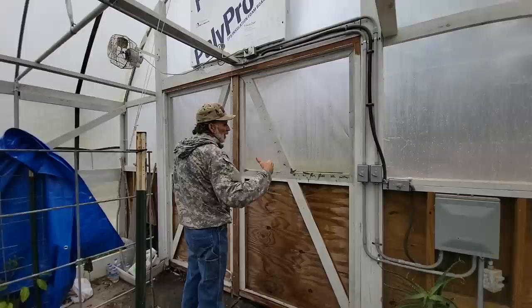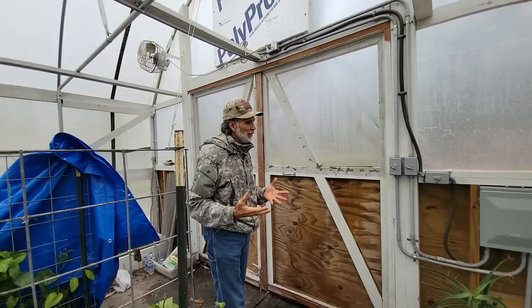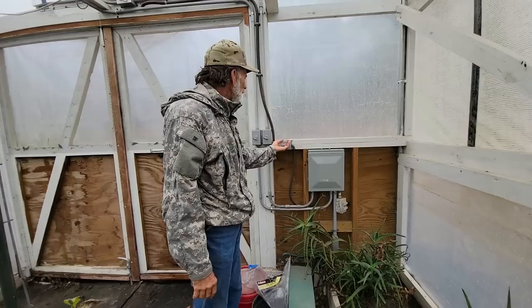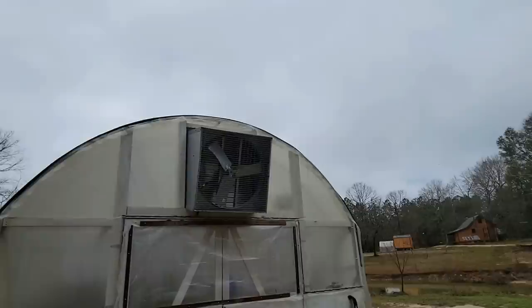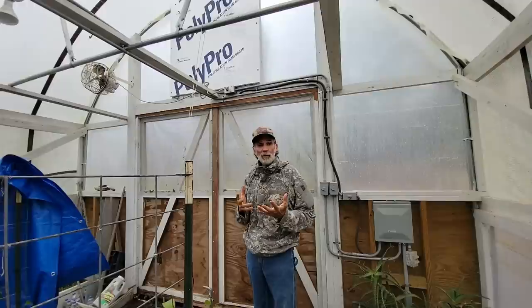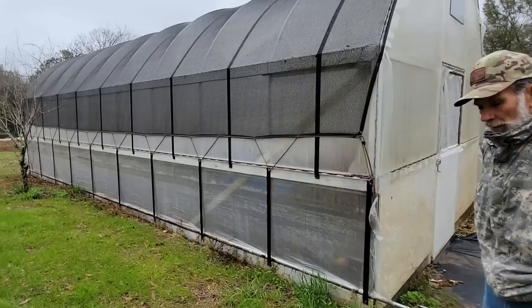Right now we have plastic on the outside of the double doors, but they do have screen on them. During the summertime we just close them up at night - we don't close them during the day. In the day it lets the pollinators in. At night is when insect moths fly in to lay eggs. It's all wired in conduit because there's lots of moisture that gets in a high tunnel. We have our own receptacles, breaker boxes. One turns lights on, one turns fans on, one turns oscillating fans on. Because Wanda's has a large fan on this end with a set of louvers and then a set of louvers on the other end that open, we had to put some one-inch-thick styrofoam up here during the coldest parts of winter because our heat was escaping out those louvers.